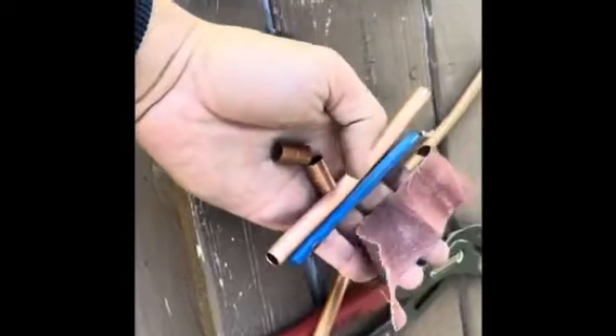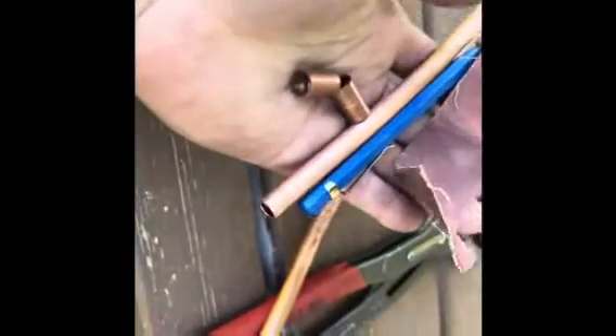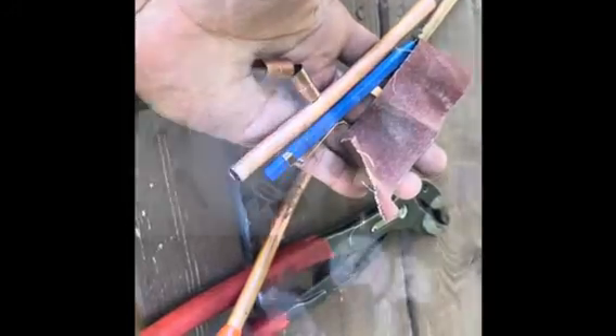Got the first part. The bottom part is going to be a lot more difficult — I'm going to heat that up and use my channel locks to remove the filter. I went ahead and cut the piece; I have some couplings. Make sure you clean up the copper with sandpaper and deburr the interior. Just make sure you clean it up as well as you can before you begin soldering.